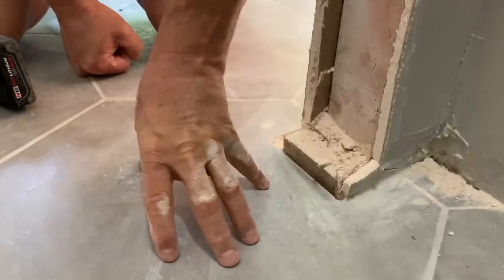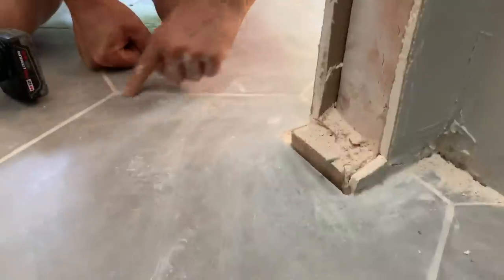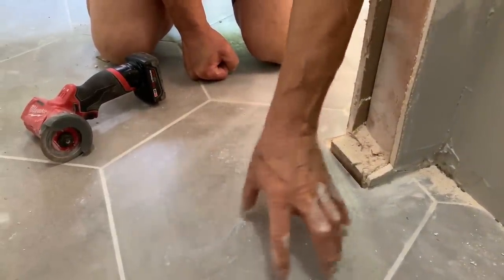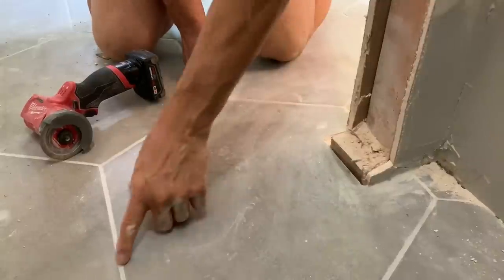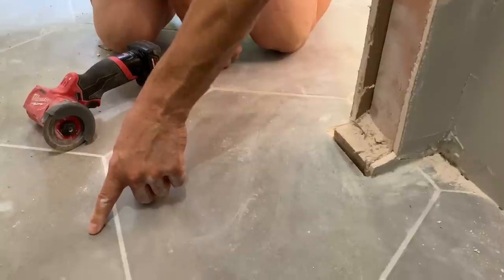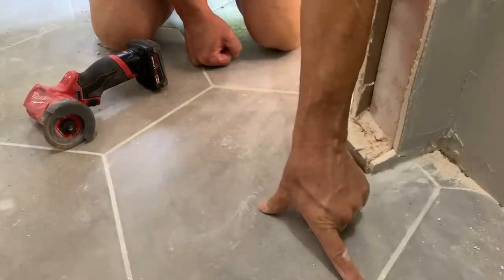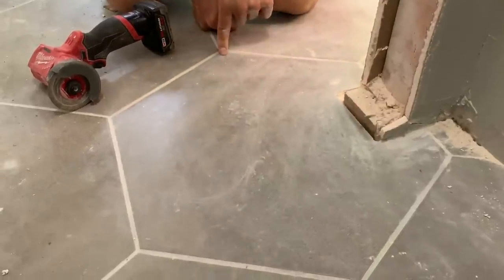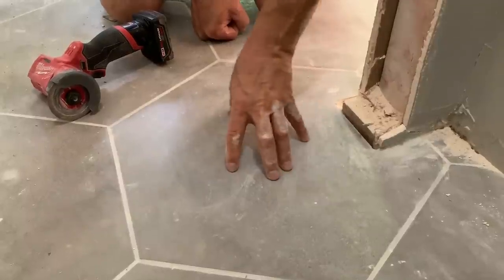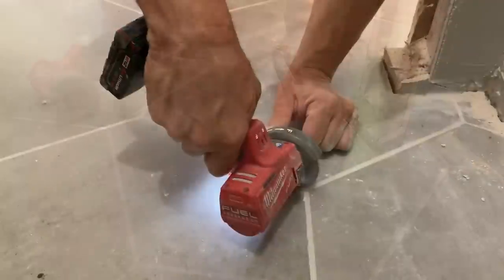So generally when I take a tile out, what I do is to first go in and cut the grout line around it first and then break the tile up, because I've seen that with some tiles, if you start beating on this tile with a hammer, because the grout does adhere to both tiles, I've actually seen the adjacent tile crack, which just makes it a bigger problem because then I gotta replace two tiles. So I've also, in some cases, will run a score line down this tile, maybe this way and this way, so that when I break it up, it actually breaks cleaner and it takes some of the pressure off the surrounding tiles, because we don't wanna start breaking up a whole bunch of them, we just wanna replace the single tile.